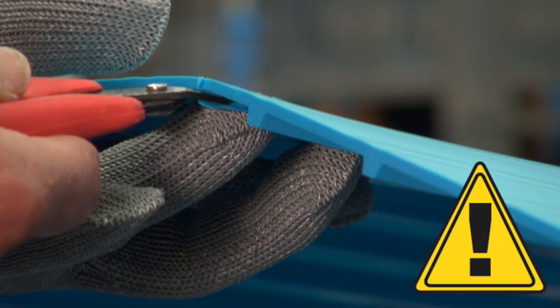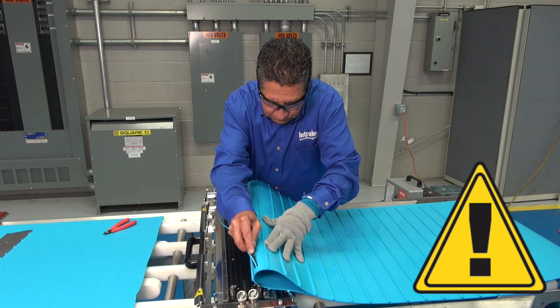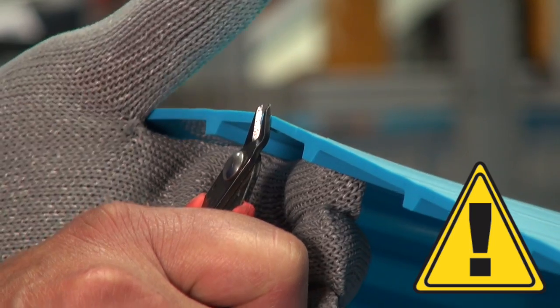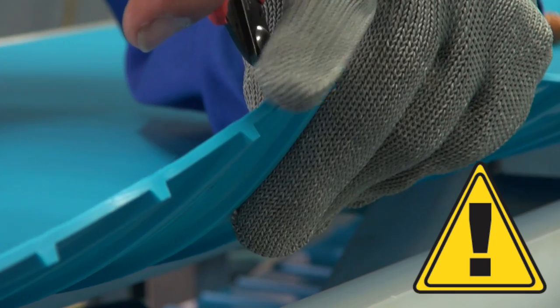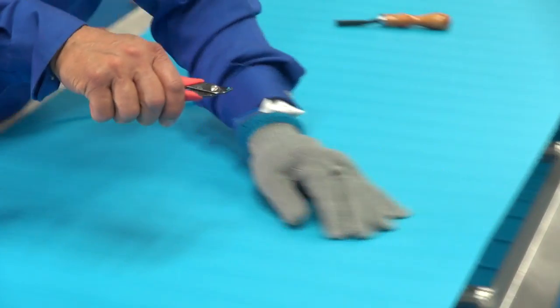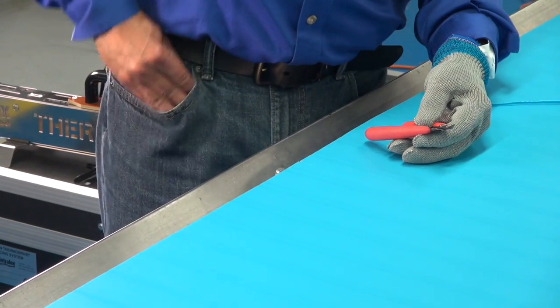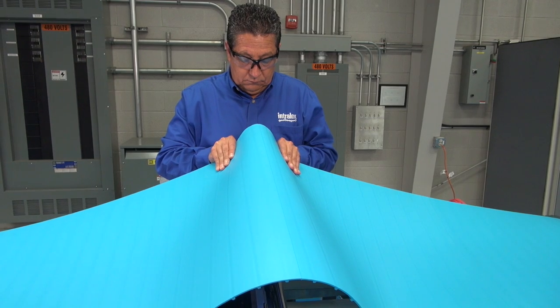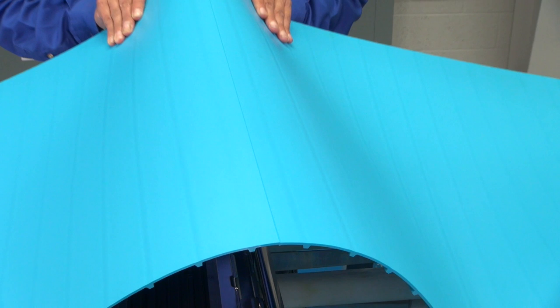To remove the bead from the underside of the belt, use trimmers to separate the bead from the belt surface, then use the skyver to remove the bead from the underside. Hold the trimmers vertically to remove the flash from each edge of the belt. If needed, use trimmers to smooth rough or offset edges. Ensure every plastic particle is collected and properly discarded to avoid product contamination. Then visually inspect upper and lower surfaces of the belt, looking for cracks, bubbles, or pits. The top and bottom of the belt should be smooth and flat at the splice without waves, bends, or offsets.